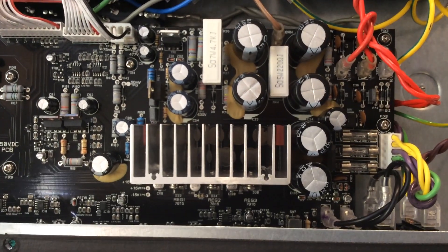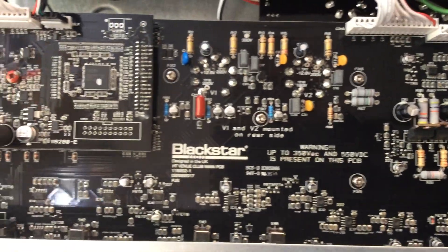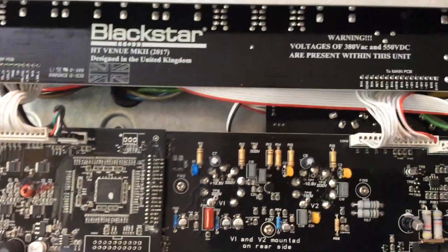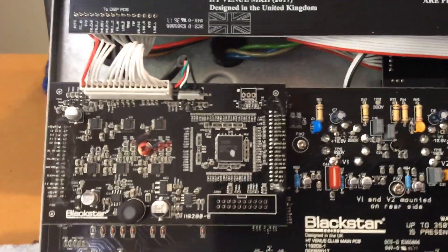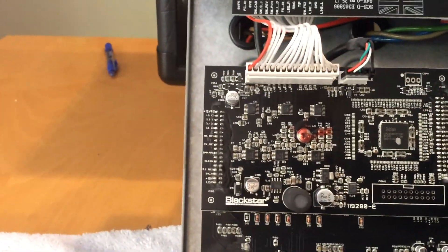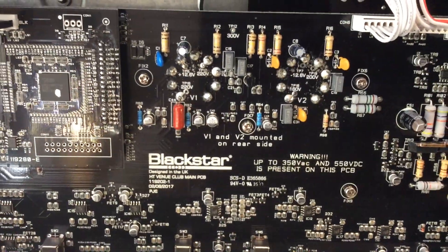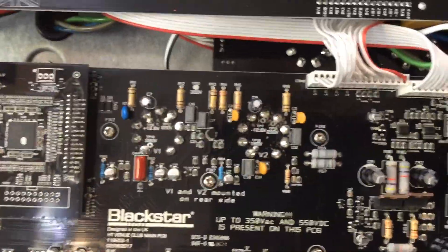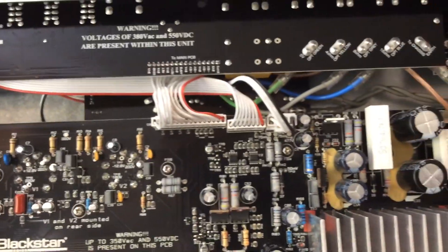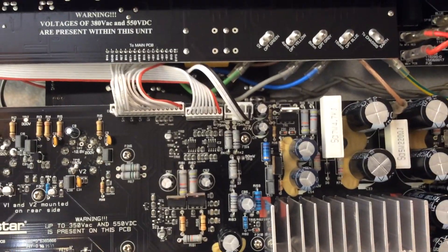You've got those three fast-blow fuses, a couple of CMOS devices that you might get lucky with. Otherwise your best bet is going to be to identify a bad board and just replace the board. It's no wonder you can't find people to work on these. So that's the printed circuit board — not nearly like the ones in the Ignitor. The Ignitor boards are by far the best I've seen so far.